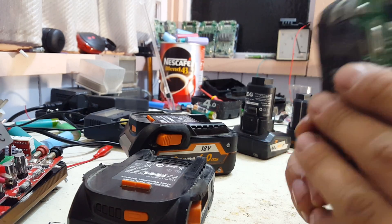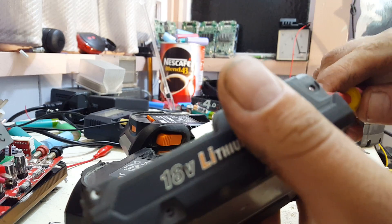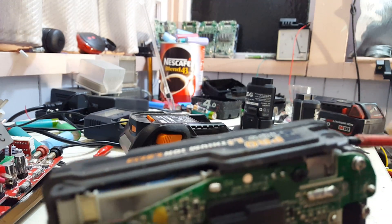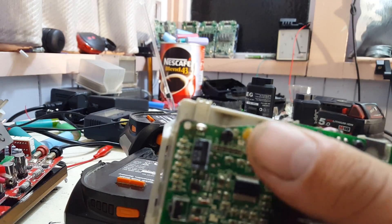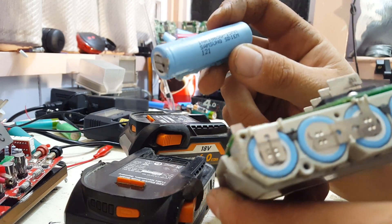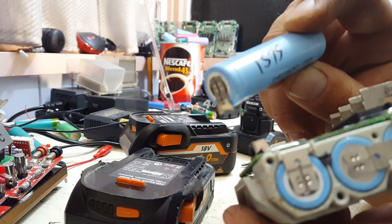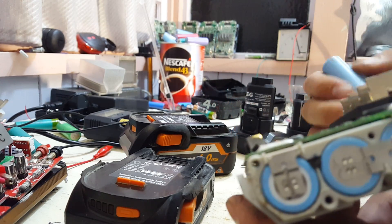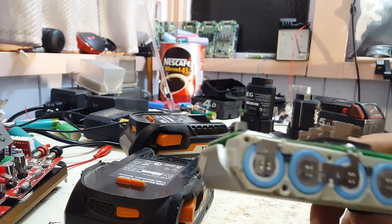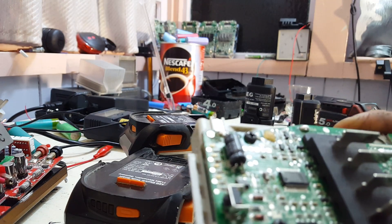I'm yet to test it out, but I'm thinking it could be a charge controller. Using a flat blade screwdriver, I can gently slip that in the sides — side comes off, exposing what we've got here. I've got one out of a different pack, maybe even a Milwaukee pack — same thing, doesn't matter. INR 18650 — this is Samsung — and that one tests out at 1575 milliamps. So this is a 1.5 amp hour pack. That means we've got another five potentially excellent cells — probably nothing wrong with them — it's just the fact that the charger won't play ball, or the circuit board dies.